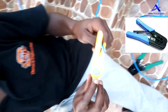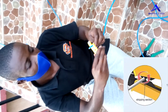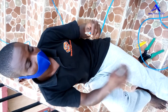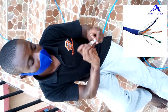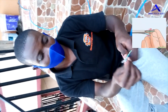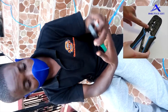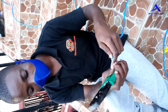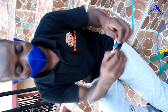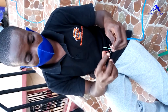Pick your ethernet cable and use one of the crimping tools as shown on your screen. Insert it on your wire and cut to remove the outer cover. Unpack the wires carefully so that you do not tamper with them. Make sure you are left with the plastic part at the center. Cut that plastic part carefully using the crimping tool. Once done, the wires are unpacked — they are always twisted — so straighten them up as shown in this video.